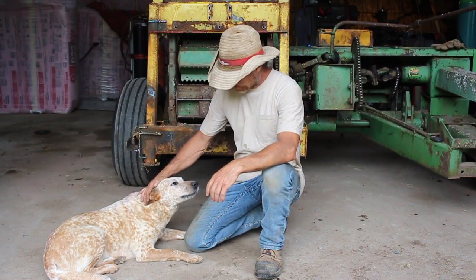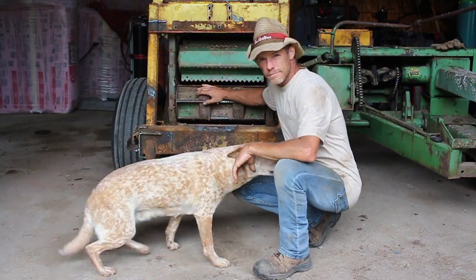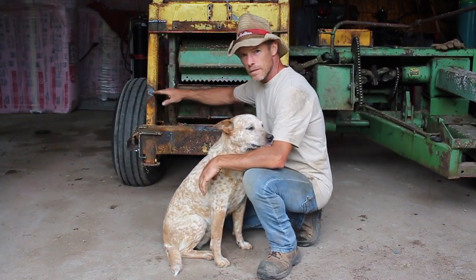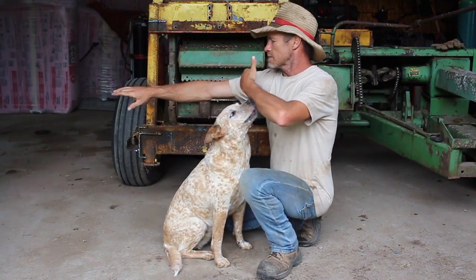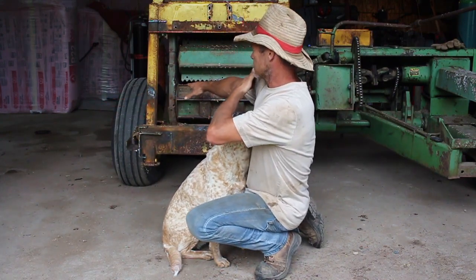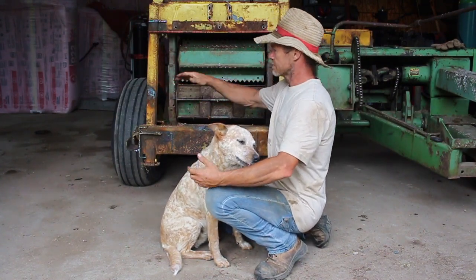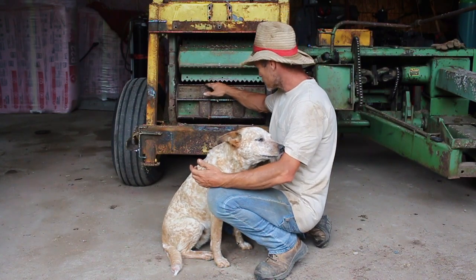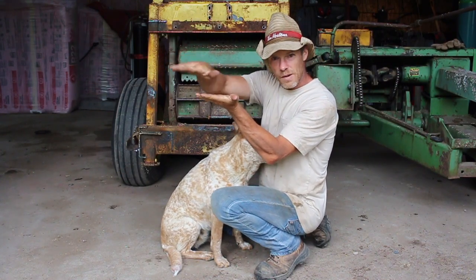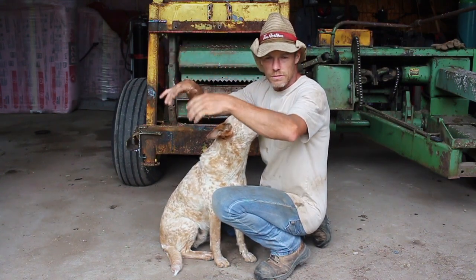So YouTube, this is what I'm starting with. That's where my feed is for my branches — my new wood chipper. I'm going to make the bottom of my box that comes out at least two and a half feet, so when you're running it you're too far away to touch anything. I want to put the bottom of my infeed chute level with the bottom two rollers, so when there's wood on the chute it doesn't bounce up or bounce in and make the branch go all over the place.